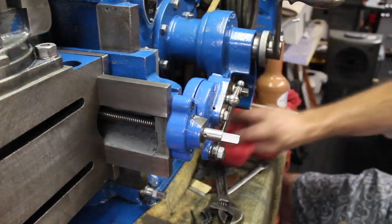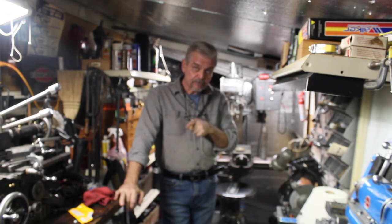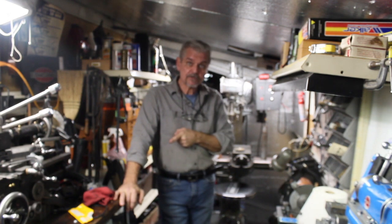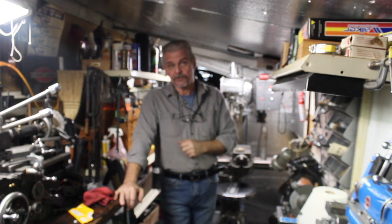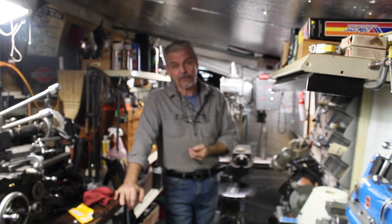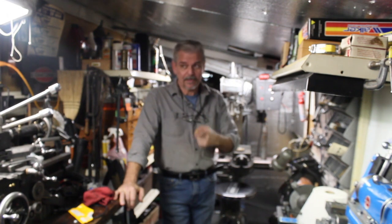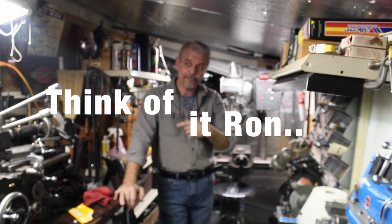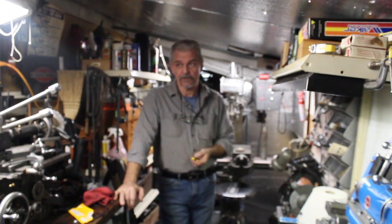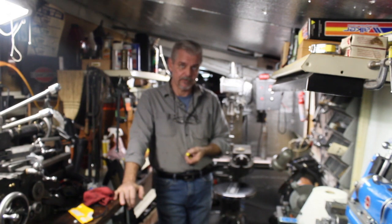Well, thanks for watching. The next video for sure will be the start of the South Bend 9 and the upgrades I'm going to do to it. So be sure to come back to see the South Bend 9 get her upgrades, okay? And hopefully we can get rid of all those striations every time I try turning something. I think the thrust was off. I know the bearing spacing was off, so it's got to be better than that when we get done with it. Maybe.